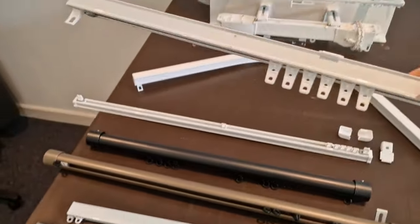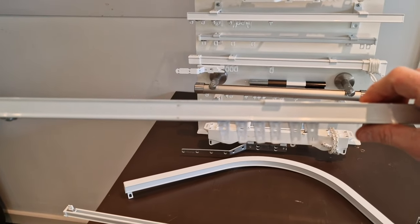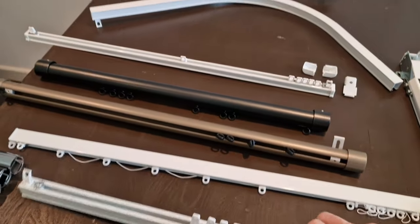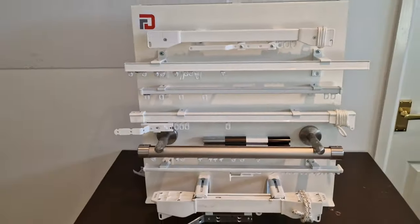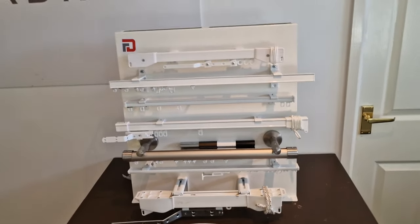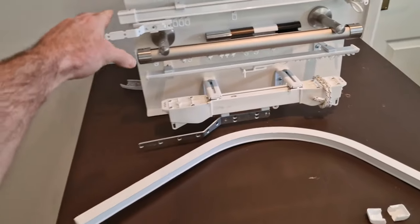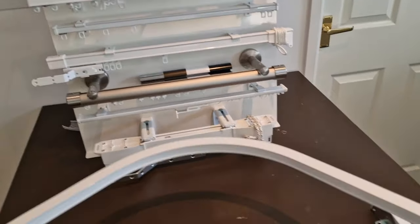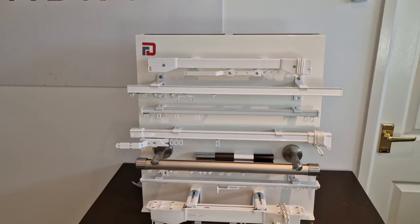That's obviously top fix, very slim line profile, and can have wave gliders. It can also be wall fixed with our standard wall bracket. It's a nice heavy duty rail — we say 25 to 40 kilos, though obviously no matter what track you have, it's all to do with the substrate. Internally we can bend this track; we have our bending machines here, so if you want a bay window we can also do that, and that's the same across the board with all these products.